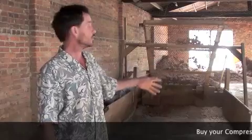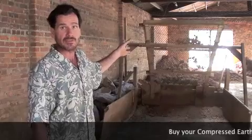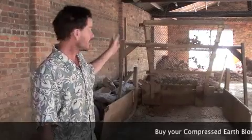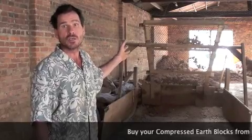This is the first stage in sifting materials for the compressed-earth block. We'll take the raw soil material, pick it up, drop it through the screen. This will size it, get all the large material out, and leave us with about a three-quarter inch or smaller soil.